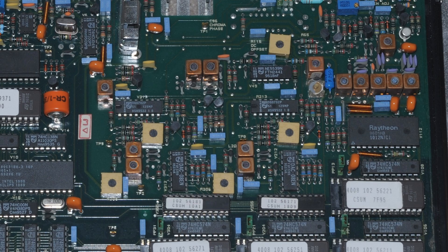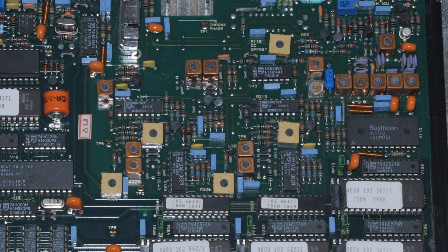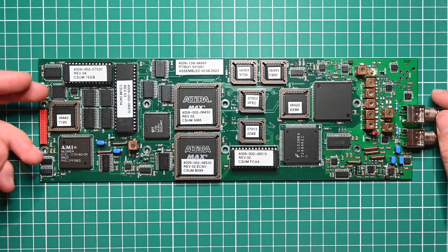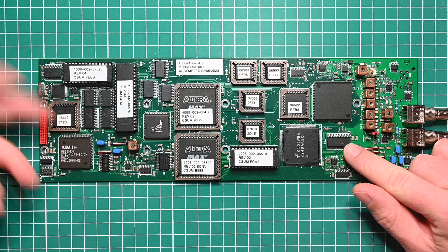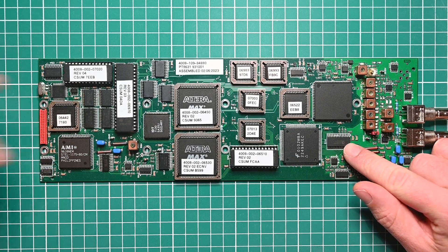I'm going to link to a little bit more information about that in the description. The disadvantage of this design is that it is not possible to generate both PAL and NTSC, because to switch between the two it has to be retuned and that is not a trivial exercise. On this board there is only one DAC; however, somehow it still has that same variable phase relationship feature of its predecessor.